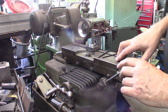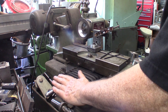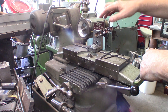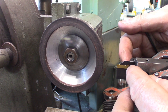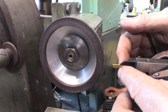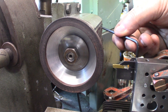The grinding table here — the motion is controlled with this handle, this lever. I can control the back and forth direction with this lead screw. General setting up on the low angle precision angle block, held with a cam-twist clamp. You can use anything to hold it, but I'm using the tool holder itself. We're now ready to install the insert. Since I want to get the insert in — it's a 2mm insert and the holder is meant for a 2mm insert — you're going to have to bring it a little bit forward so it clears the holder's sensitive parts. Then you tighten the screw on top to make sure the insert will keep its place.